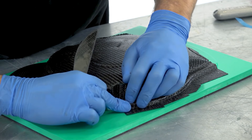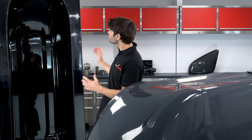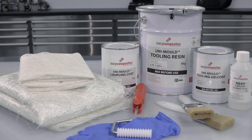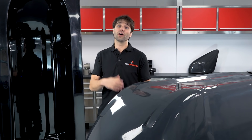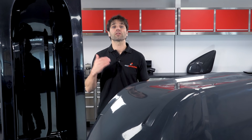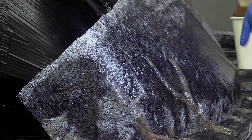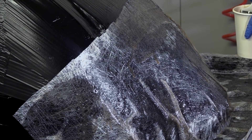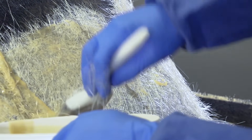There are of course many different materials you can make a mould from, and in our back catalogue of videos you'll see many of these being put to use. But for a relatively large room-temperature-use mould like this, the UniMould system is absolutely perfect. It's very low shrink so we retain the dimensional accuracy of the pattern. It's very fast to work with, cost effective, and features direct contact with epoxy resin. In this video I'll be coating the pattern in release agent, setting up the flanges and barriers, applying the UniMould tooling gel coat, a coupling coat laminated with lightweight chop strand mat, and then the main reinforcement using tooling resin and 450g chop strand mat. So let's get started.